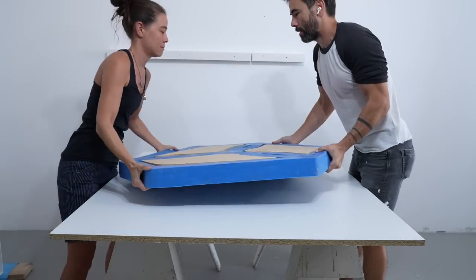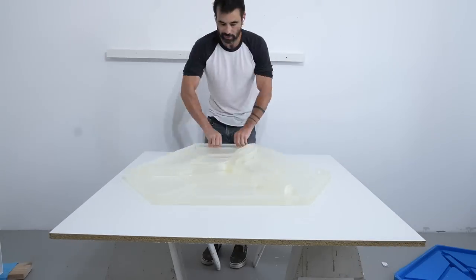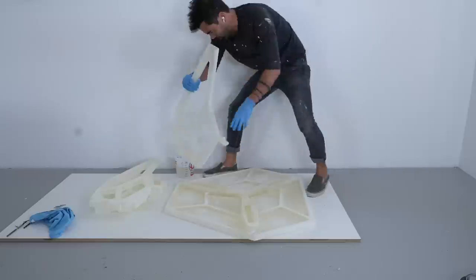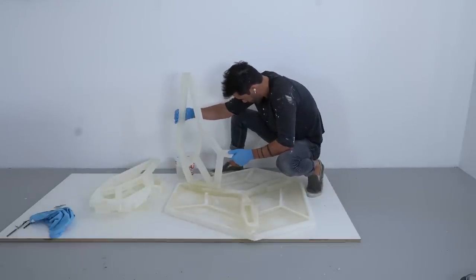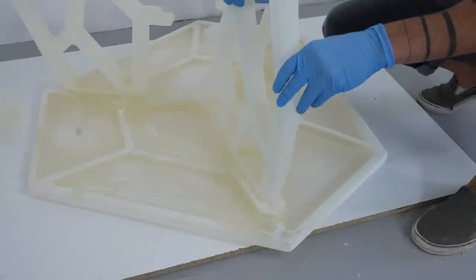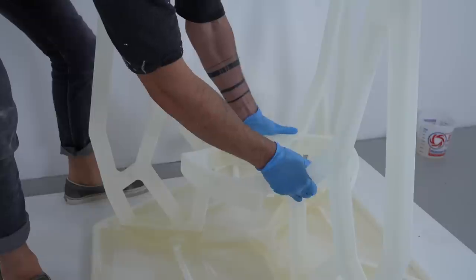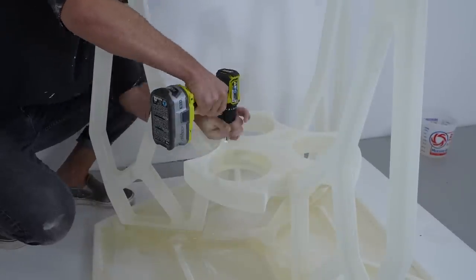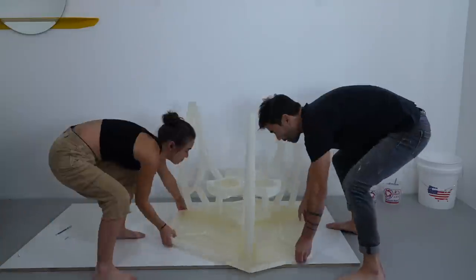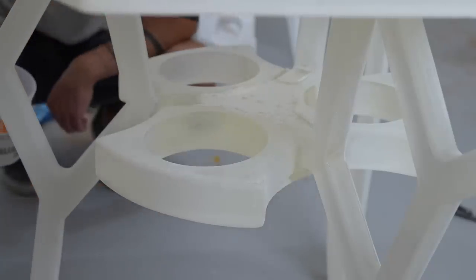All right, back to the build. I let them cure for about eight days. Removing the epoxy from the silicone is way easier than from the MDF prototypes — once I remove the filler pieces in the back, which already have little chewed-away handles, the silicone has a lot more flex and just peels right away from the epoxy. I sanded all the pieces with 220 grit sandpaper on my orbital sander, wiped away all the dust, and was ready to assemble. I mixed up another batch of epoxy and poured it into the sockets on the underside of the table, then placed the legs right in. Epoxy is a great glue for epoxy, and with the leg design I created these little hooks and nooks so that the glue layer would bond the two pieces together. The middle support adds rigidity to this three-legged table — I put in three screws temporarily so that once the glue epoxy cured I could flip the whole thing over without the legs wobbling. Then I sealed up the cracks between the legs and the center support with clear silicone so I could pour a glue layer into the cavity in the center support to bond it to the legs.